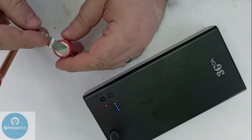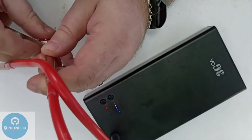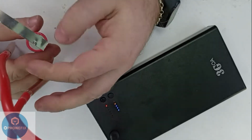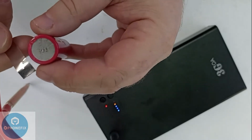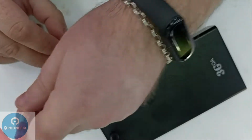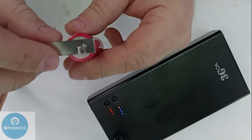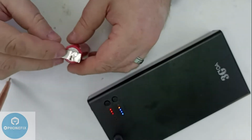Now we have put it in automatic mode and we will try at a minimum current. One diode is lit. Weld the nickel tape from the kit to the battery 18650. It is enough to install our welding wires in place and welding takes place. In the first position, we see that nothing has boiled, that is, it has only caught. Let's set half the power and try to boil at half the power. Here we can already see that the welding is going much better. The tape already lends itself to a more serious load when torn off.